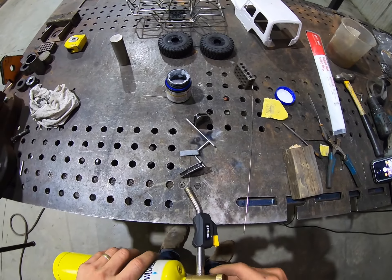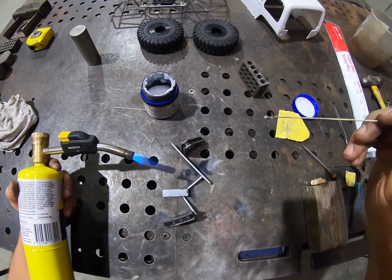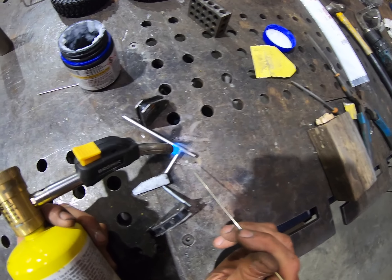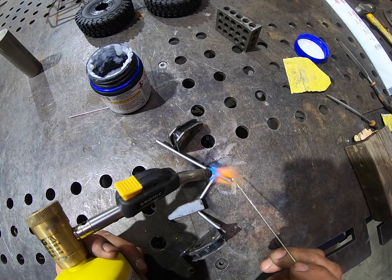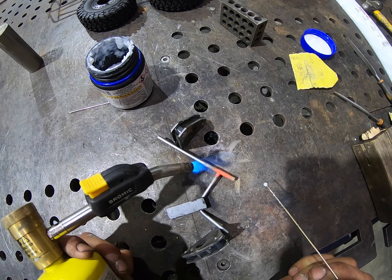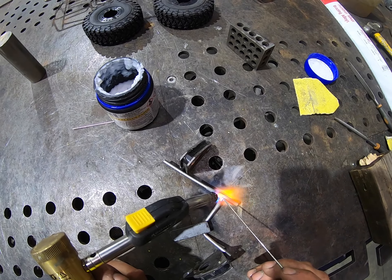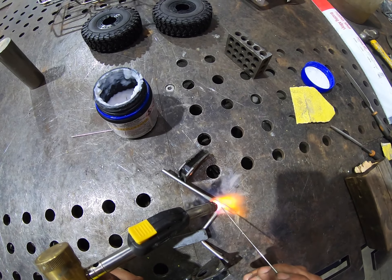Let's give it a crack - crank up the heat. It's got a bit of flux on the end there. Evenly heat up that join. You'll see there it's going quite red. Just like that - and I'll start just slowly dabbing that. You can see it's changing color. Just like that - and there you go. Dissolve.